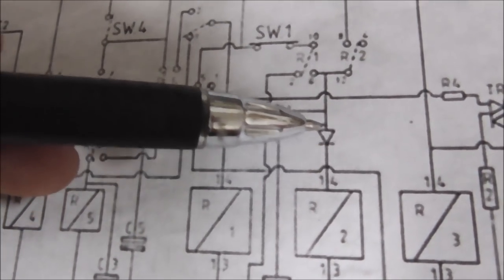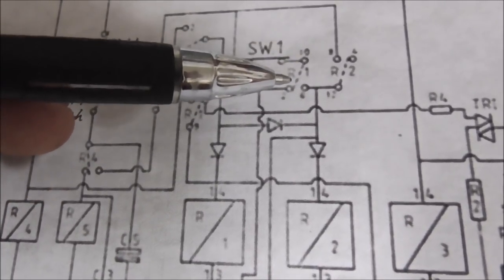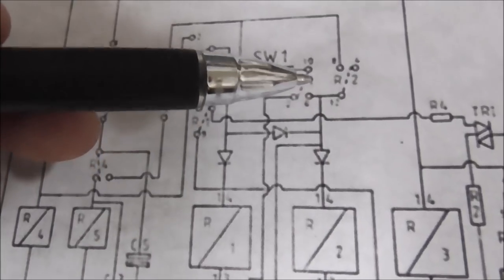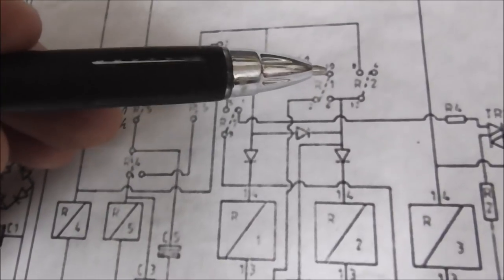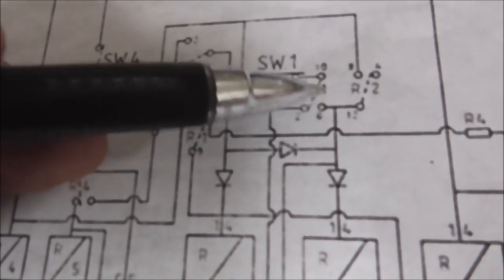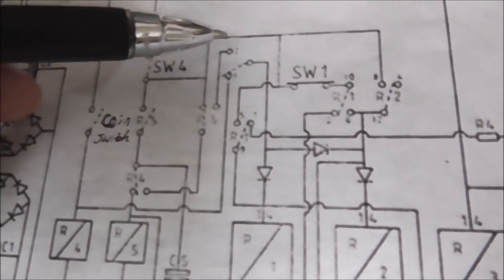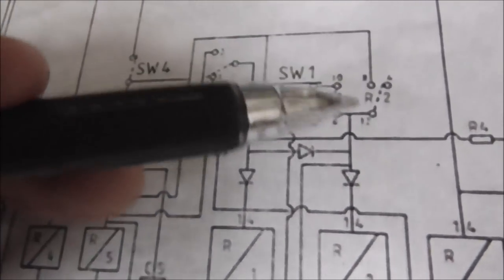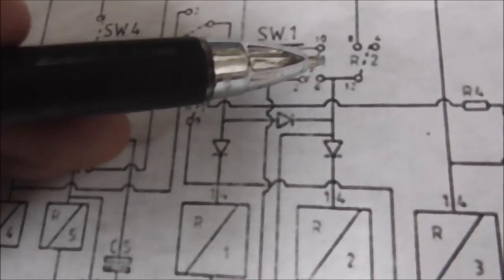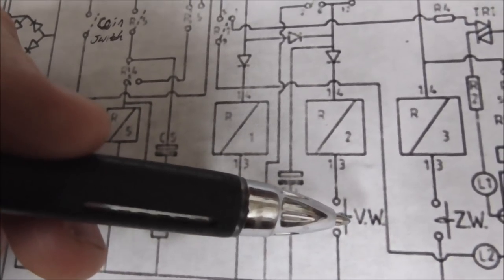relay 2 should energize through this way, you know, and we've already got this going. So it's getting power. Yeah, it's holding itself on through the switch on relay 1. And relay 1 cannot open until switch 4 opens, right? So it's getting power to itself through relay 1. So I can hit that button and hit it 2 or 3 times, it looks like, if I want.